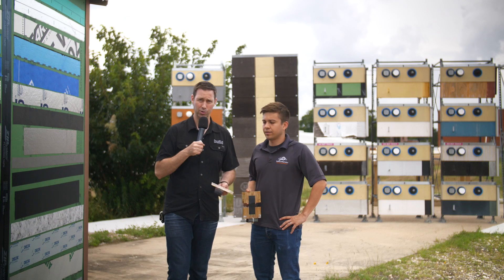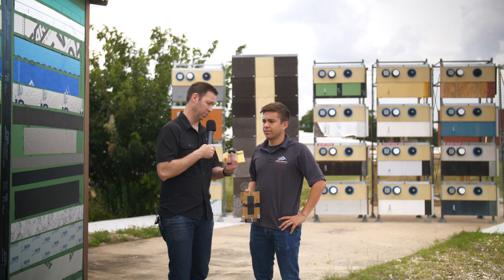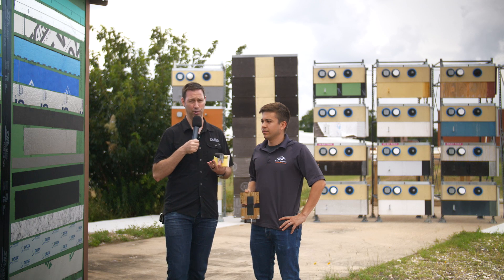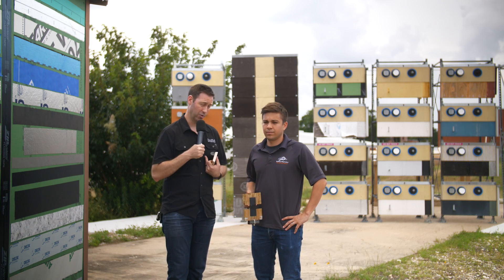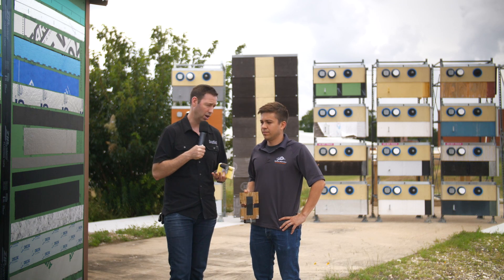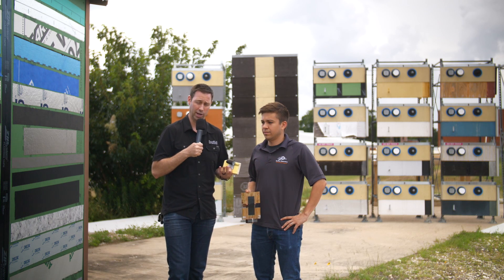When it comes to modified asphalt, which is going to peel off — that doesn't necessarily mean it's a bad product or that it's not water- or airtight. What it does mean for me as a builder is I need to treat that differently. I need to take care of those areas that could peel off by, let's say, mechanically attaching those.